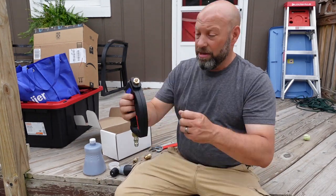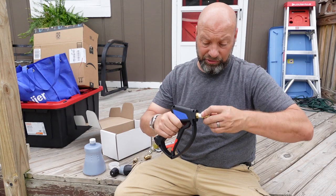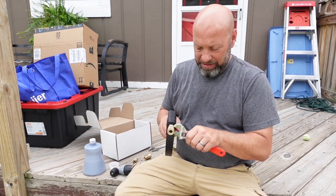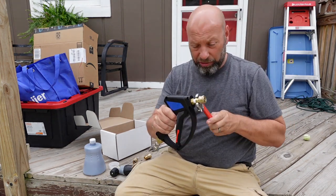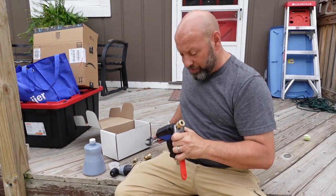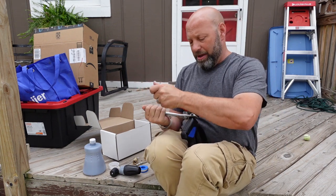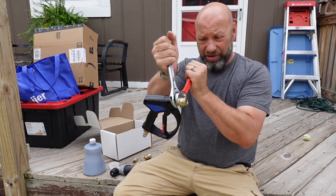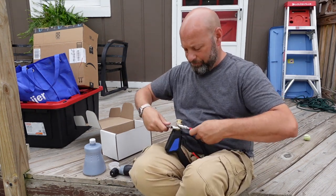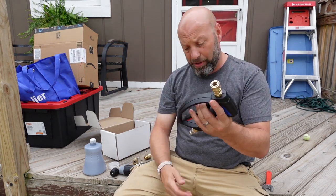Take your gun — it's going to give you a bolt head here and a bolt head here. Use those. Don't think you're going to hold the gun by the handle and start wrenching on things — you'll actually break your gun. They give you that bolt head for a reason. Take your other adjustable wrench, put it right on there, tighten it up, and you can then tighten the top fitting up — pressure working against each other so you're not damaging the gun. That's our quick release coupler on there, locked and done.